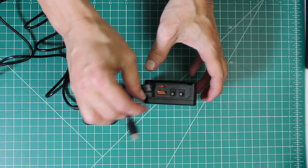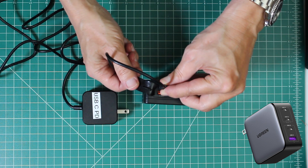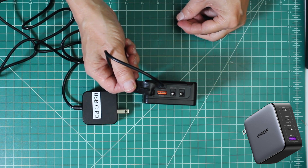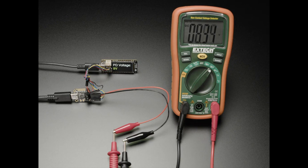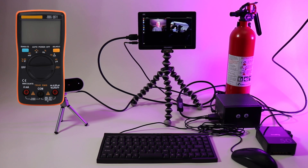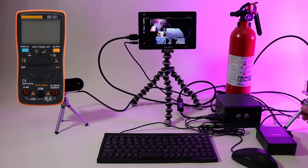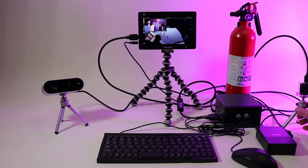To charge the battery, you can use a USB-PD charger or a D-Tap charger. USB power delivery is easy to integrate into your projects - there are lots of breakout boards available. Let me know in the comments below if you want to know more about that. When wiring up your projects, use a multimeter to test everything. It's no mistake that you see a fire extinguisher in the videos. Also, the batteries store a lot of energy - you need to respect the power that they contain.